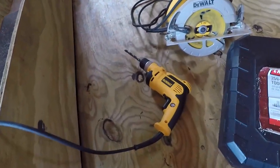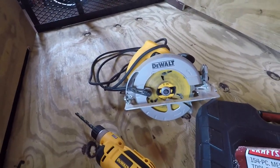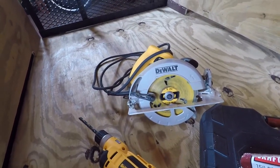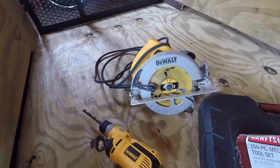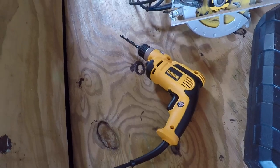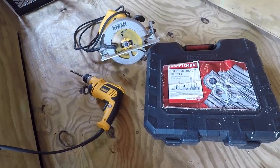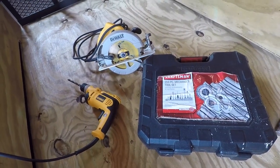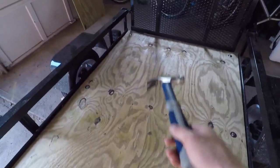I just wanted to mention that today I'm using some DeWalt tools like this DeWalt corded circular saw. I got tired of using cordless circular saws because they always seem to run out of juice — maybe just because mine are old — but I like using a corded saw for projects like this so I know it's not going to run out of power. Similarly, I've got the DeWalt corded drill and this Craftsman socket set, which always comes in handy. There's a link to all these products in the description box below. I ended up putting six bolts on the sheet of plywood on the floor — one on each corner and then one on each side about halfway down — and I think it's pretty sturdy.